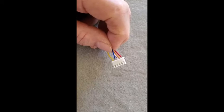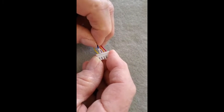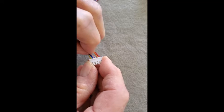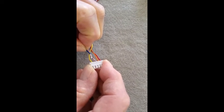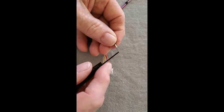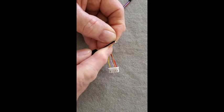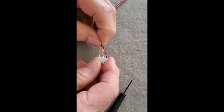The full order is yellow, blue, pink, orange, and red. If one of the wires fails to stay in the socket — meaning the retaining clip is damaged from pressing too hard and keeps pulling out — we can repair that. The small metal tab that feels sharp: if it is pressed down too far it will not stay in the plastic connector housing, so we take a screwdriver and move it up a little bit.